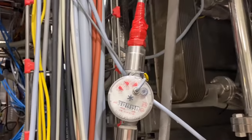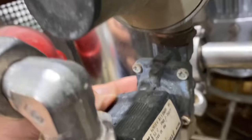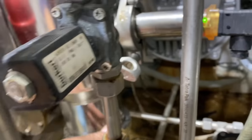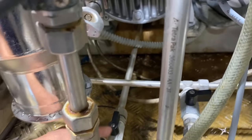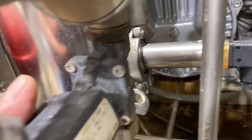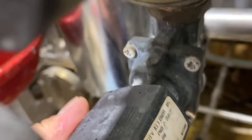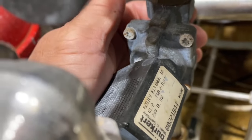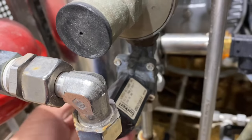Hello guys, have you seen the water leaking in the scrubber here? This one. So I'm planning to replace this solenoid valve because the water flows in this area from the supply, so it goes here, then up from here going to there. So this solenoid valve is no longer supplied, it's not activated, no 24 volts as of now. So why does the water still flow inside? It means maybe there is some dirt in this valve or it's already broken. So we need to replace this.